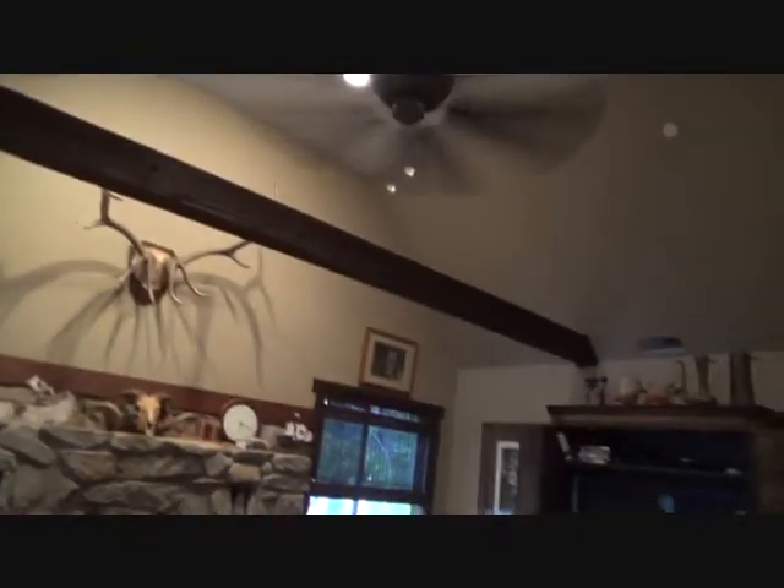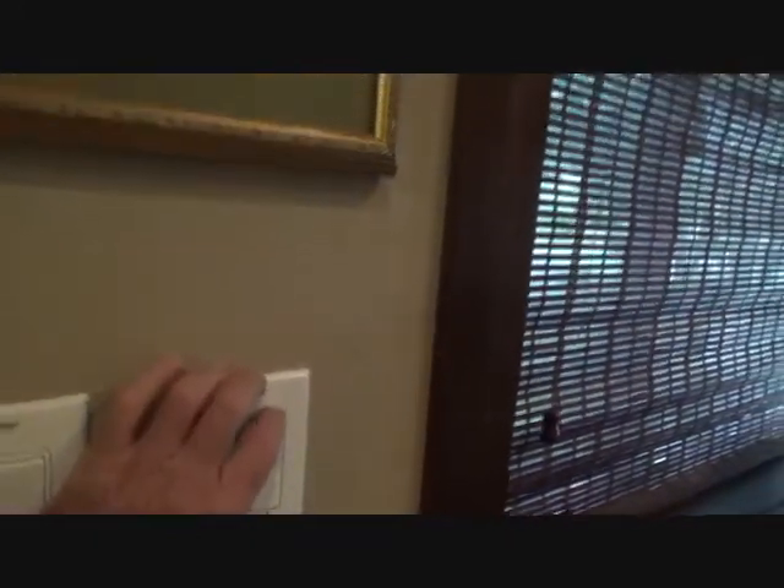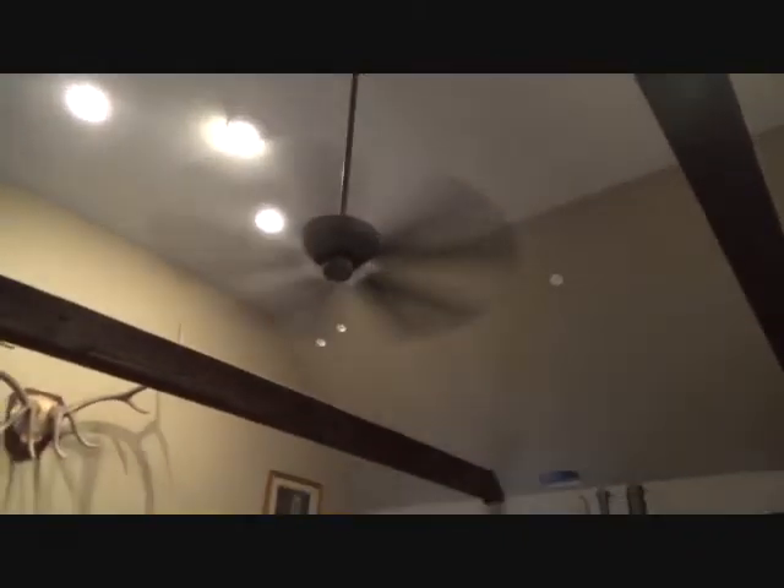You rewire the module and you slip it up in there above that cover, put the cover back on. It's very easy to do. Most ceiling fans, you can do this. And then you have the remote control and voila, everything works. Or if you want a three-speed wall control, you can put that in — and that has a little remote control in it, but you still need the module that you put way up high. That's something you can do pretty easy on a ceiling fan.